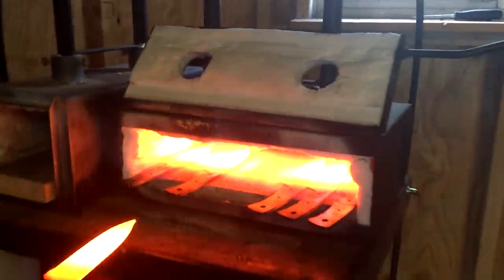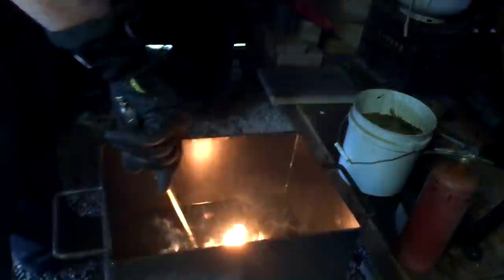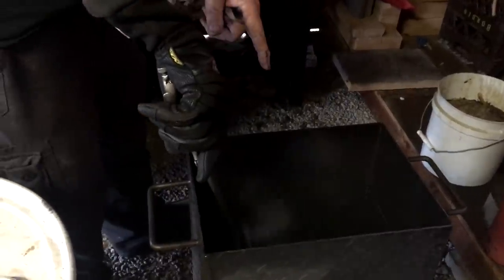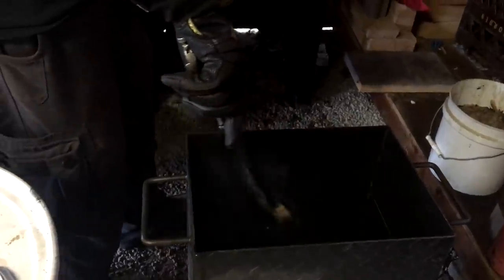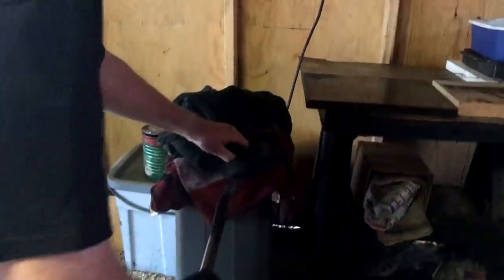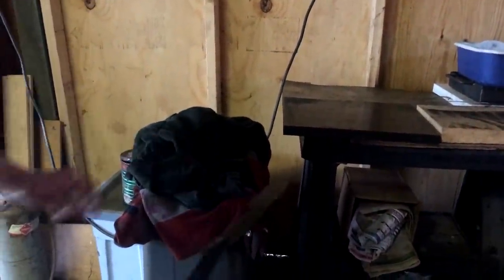I'm going to take that knife out of there now and follow me around and into the quench. I'm going to dip it just below so that it can kill the fire. As soon as the oil quits coming around it, I keep stirring it very gently. I'm going to wait for about 15 seconds to take it out of the hot oil. The knife will still be very hot at that point, but it will be quenched and ready for being cleaned off. We clean the oil off of it — we don't leave the oil on it in our operation because it's cleaner. I'm going to take it out of the oil and let it rip a little bit, then pass it between two pieces to get the excess oil off. Then we put it on a piece of granite nice and flat and let that one cool.